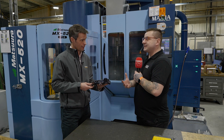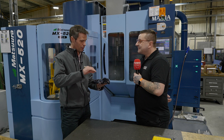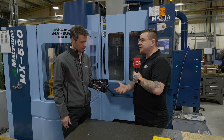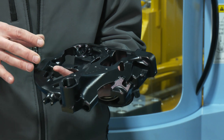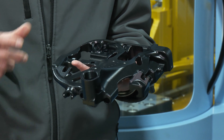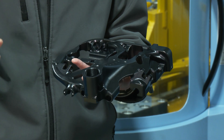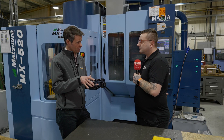Now we've finished all the Z level and now we're into detail — we start picking different elements, different surfaces on the CAD model if you like. And how easy is it to do that using HyperMill? It's easy because what we try to do is use the model to drive it — we're trying to not create any geometry, we don't really need to create any boundaries, we just click on the surfaces that we want to machine. If those surfaces aren't good enough, surfacing is within the package anyway so you can manipulate them or make your own from the original.